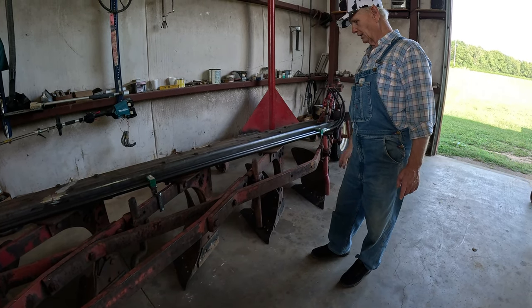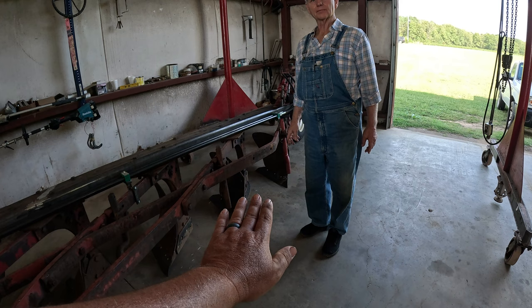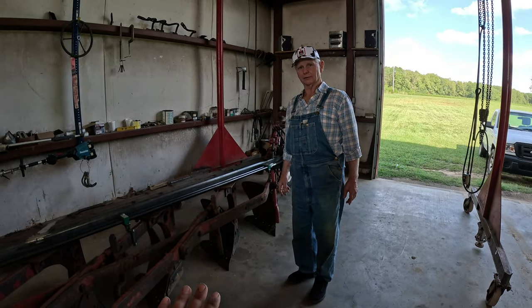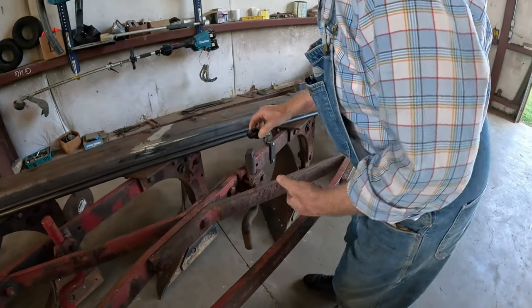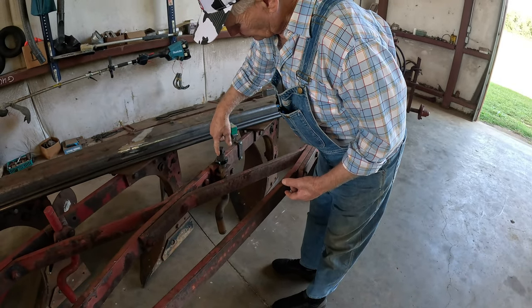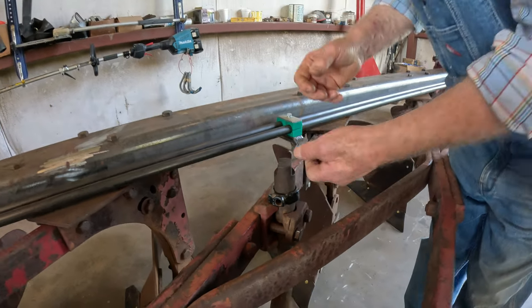And I think I'm gonna put 20 inches on this one, 20-inch coulters on this one. You've got to get it in the ground, get them coulters going true straight, and then, like I say, you do your measuring. This is right here, that's the coulter lock. Limits the coulter left and right. What I do for getting my depth right, I use that and lock it. And get it straight, and then I don't have to worry about my depth no more. I can loosen this up and turn it and not have to hold this up and turn it and all that kind of stuff.